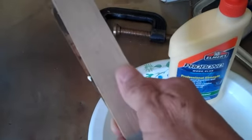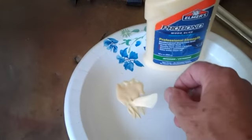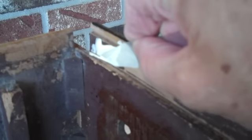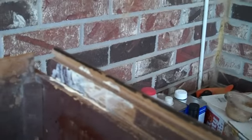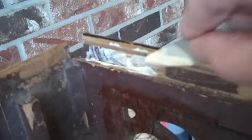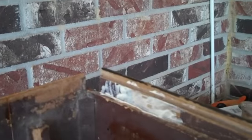It's come in handy ever since for just about anything I do. I use it to put on the wood to keep it from sticking to the cabinet wood — it's plastic, it doesn't stick. I need to get the glue down in there, so I take a very thin piece and just start slithering it down in there like that, all along — just kind of turn it around, let it dribble down in there on its own. It works real well for getting down in those cracks and crevices. You can cut these things any shape or size you want. It really does a good job. That's how I get it down between each of the layers — you've got to take your time and make sure the glue goes down in there.